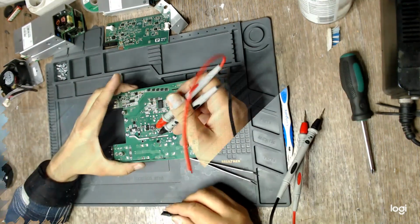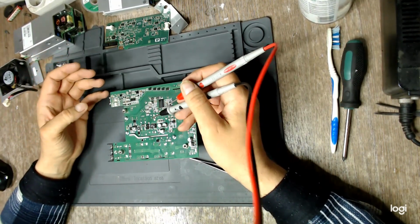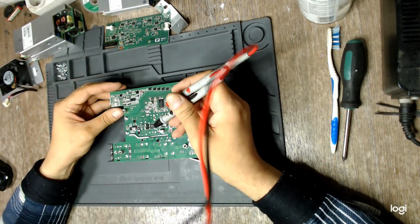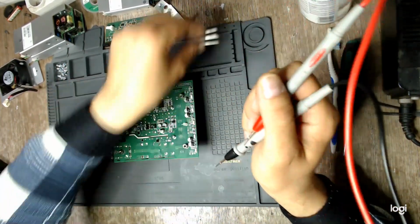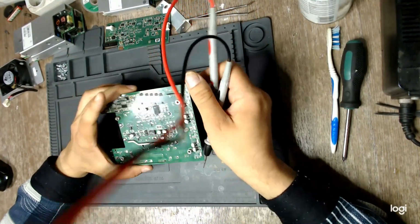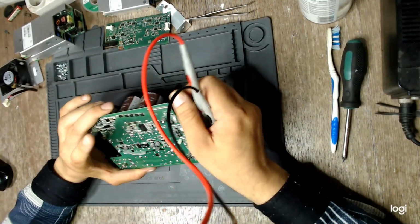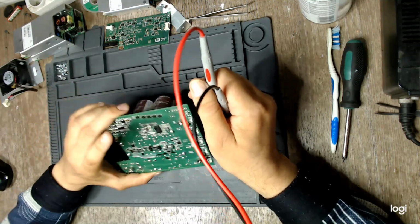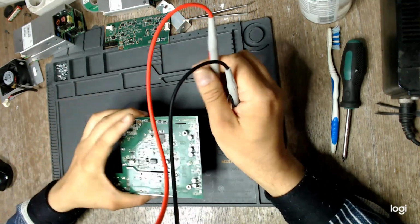Thank you, Tony, for this. Is it something on the board that increases the diode's forward voltage? It can't be. Anything on the board that could influence the measurement should decrease that voltage, not increase it. So yeah, most likely this IC is gone. And of course the gate driver needs to be ordered. What else? You know what? I have prolonged this enough.